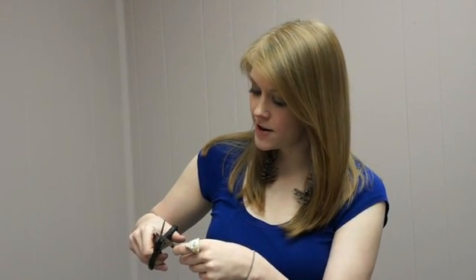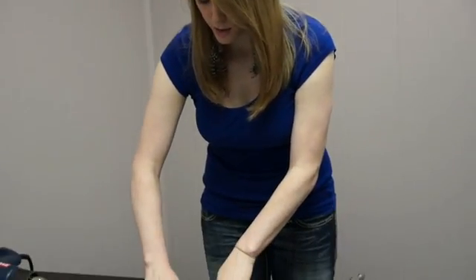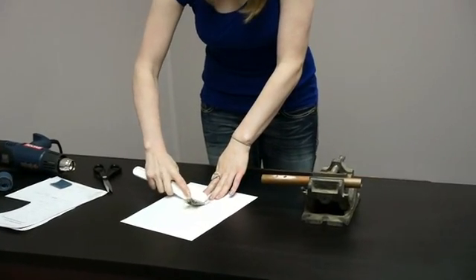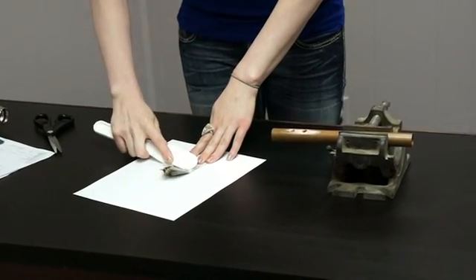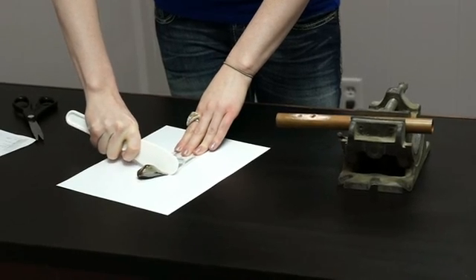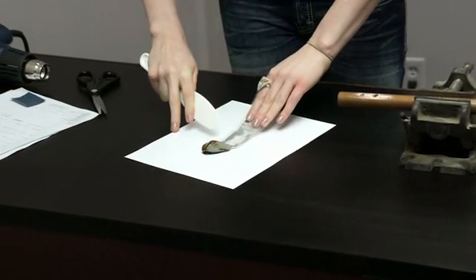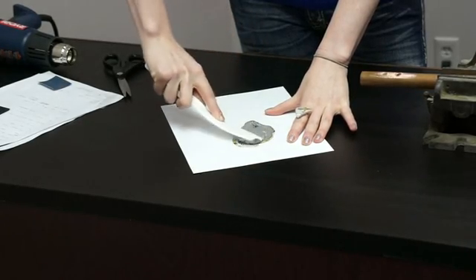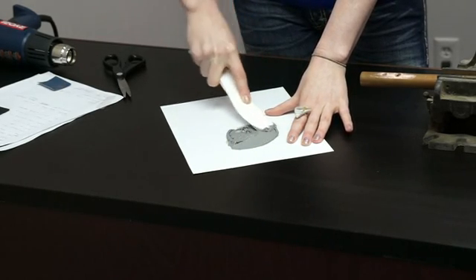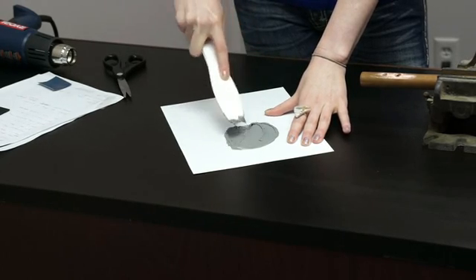Now I'm just going to clip off the very end where the hardener is. I'll lay it down on my mixing surface and begin to firmly and slowly push that resin through the PipeSeal packaging as it mixes with the hardener. It's really important not to use a porous mixing surface such as cardboard, because the hardener can get absorbed into it — we need all the hardener to thoroughly mix with the resin for PipeSeal to work correctly. It's all in the mix, so just make sure you get all of that mixture completely smooth and thorough.